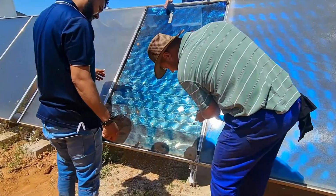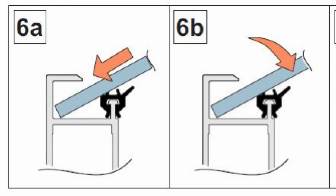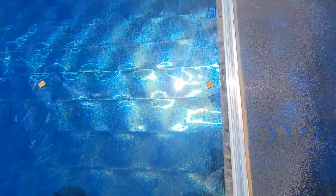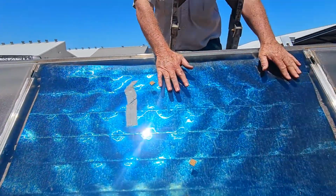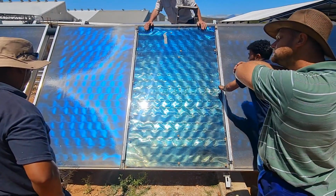Placing the glass upright helps it to get in position in the gap. Nice and gentle, does it. Again, we've bent open the corners to ensure that there's no edge on the glass to possibly risk it getting a nick and shattering. So now the glass is in position, it's on the inside edges. Perfect. And we can proceed to put on the edging again.